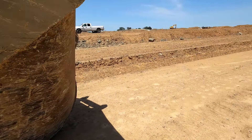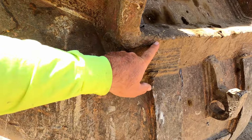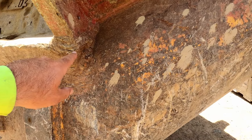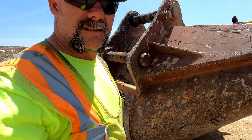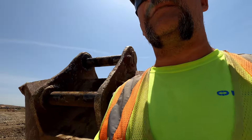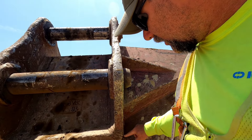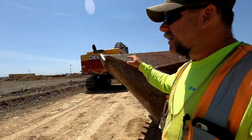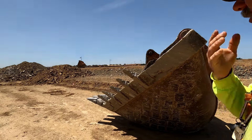We have a problem with this bucket back here. We've got a crack developing right here, and a matching one on the other side — the weld is cracked right here. Now this is kind of an odd place for this crack to appear, because normally when you're digging, the digging forces are going forward and the pressure of your ears is pushing down. So what usually causes cracks on the back of your bucket would be from reaching out and shaking mud, or just banging it when you throw your material out to your spoils pile.